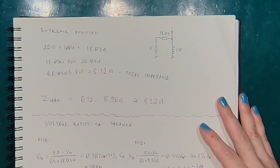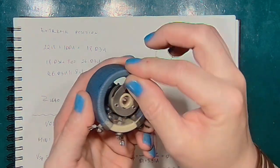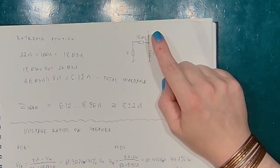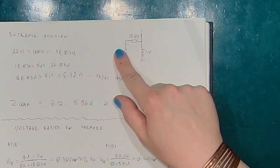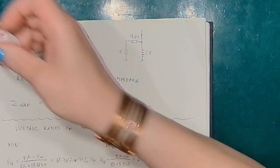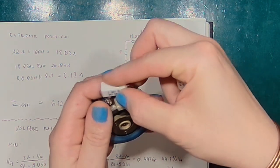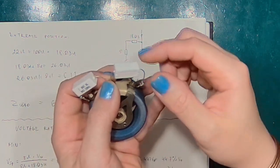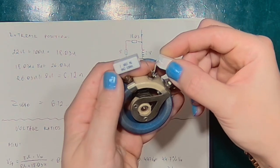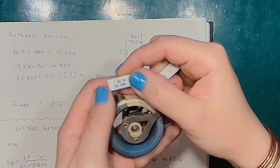But what happens when we turn the knob out of the middle position to one of the extreme positions? This turns this circuit into something different, where 8 ohms is paralleled by the potentiometer with one resistance shorted out, and the whole resistive path in parallel with 100 ohms.